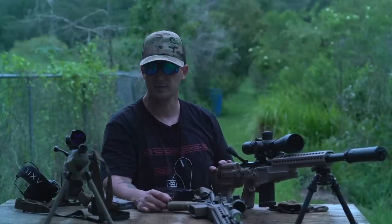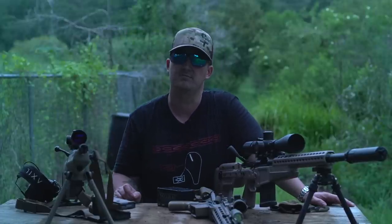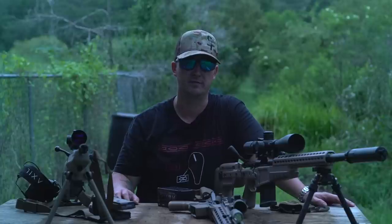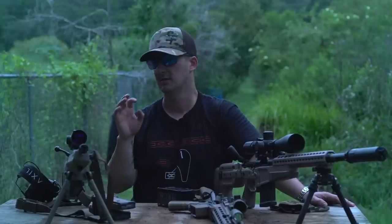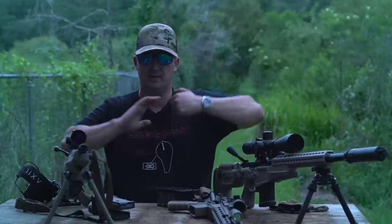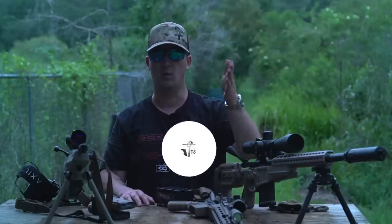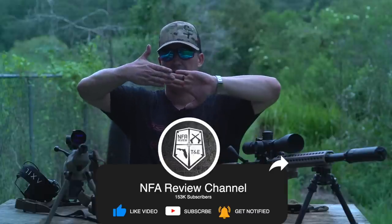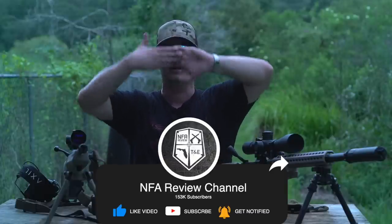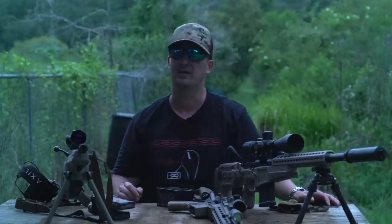So as far as complaints, my only takeaway here, as far as manual of arms of use of the suppressor, is do not wrench it on, okay? Meaning, super tighten it. Just because of the taper lock design, those forces are pulling against each other when those Acme threads engage, right? You have one taper surface in the suppressor, one on the mount, all right?